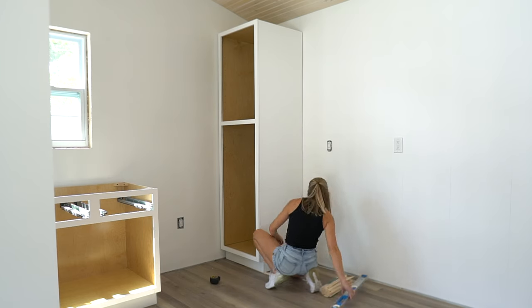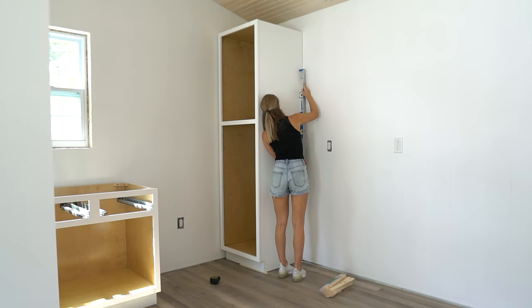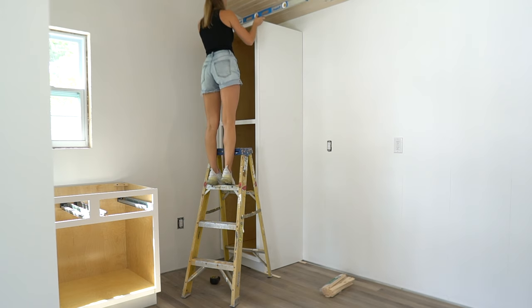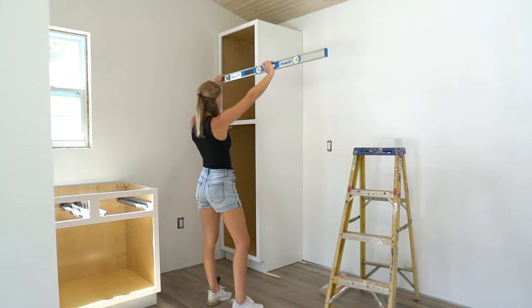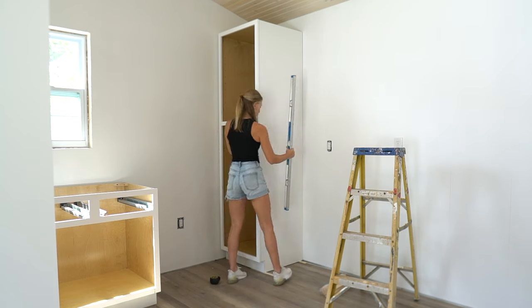What I should have done was leave a 2-inch gap at this wall, install the cabinets down the line, and then leave a 2-inch gap or so at the other end. Instead, I decided to space out the gaps a bit more and install the tall cabinets first because those were the toughest, and then work my way towards the center. Either way, make sure to leave enough of a gap at the wall so that your cabinet doors can open fully.